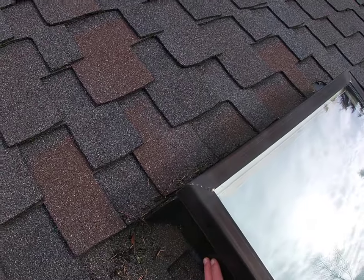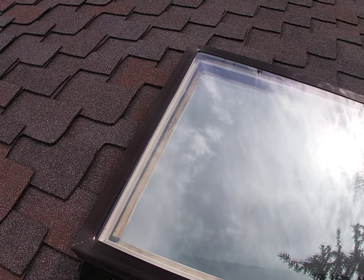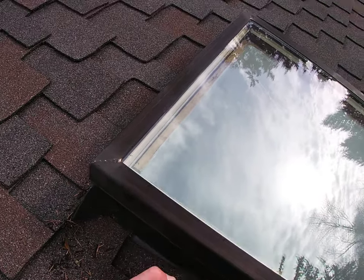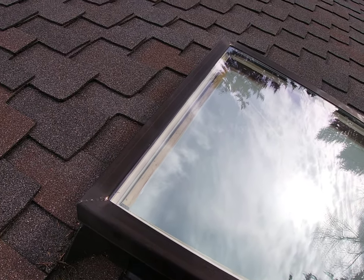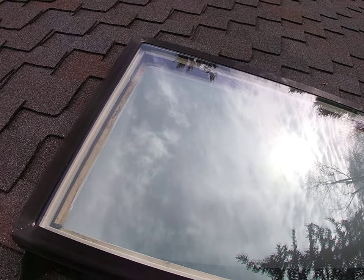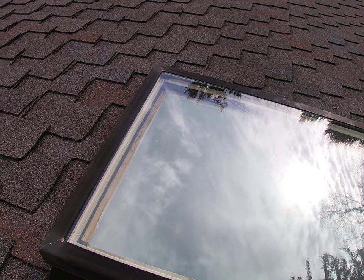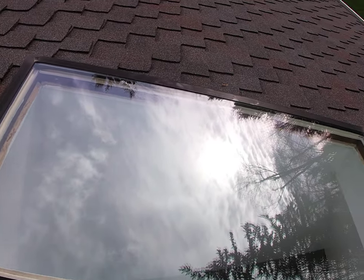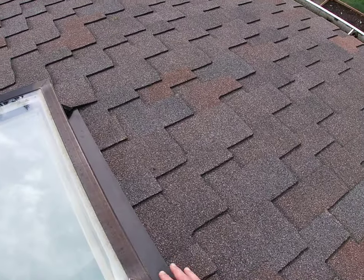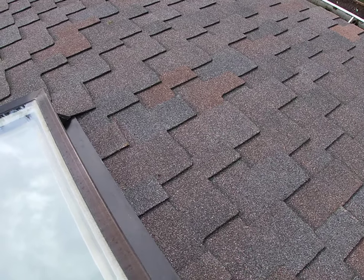The flashing — this is the flashing material, which is galvanized or aluminum. We want to make sure that the shingle is on top of that. This cap, when you see it, it's good to just overlap like that, so this one is coming up and this one is going down. This overlap doesn't allow water to go on that side — it's just gravity, it goes down. And then here there is another flashing that doesn't allow the water to go inside or under this one, which is pretty good.